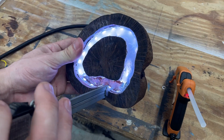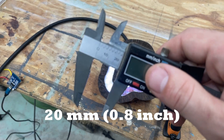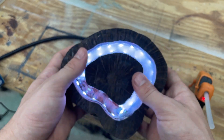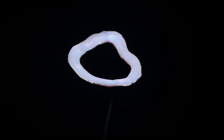The second important tip you'll want to follow for good results is to use a depth of at least 20 millimeters or 0.8 inch. Going less than that will start to show the dots of the LEDs more, like you see here. At this point you can see I had only soaked the LEDs about halfway and it's not as nice looking as the final result.